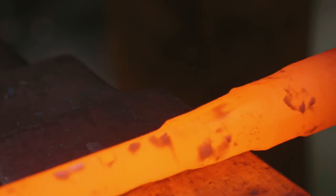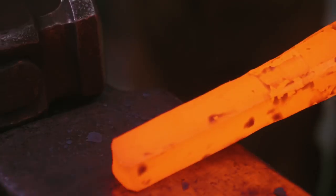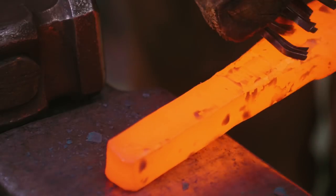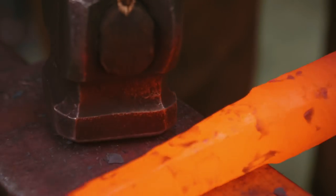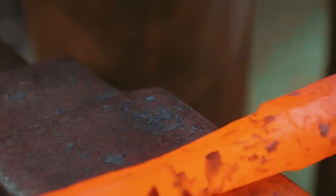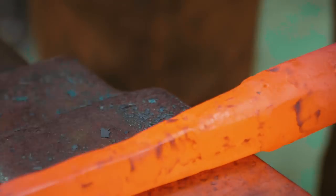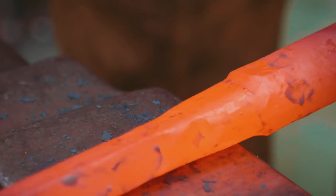One of the other issues with our first one was we didn't have an appropriate enough taper — didn't taper enough. So on this particular piece, in our preform, on all the material that's going to be cut off, we've reduced it enough that we now have a clearance for an angle of taper. It means we're going to hold a tapered angle, and actually forge a taper into this first little forged bit before we transition it into the ground material, which will also taper out.